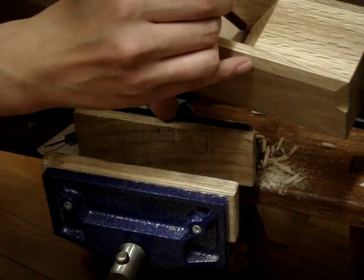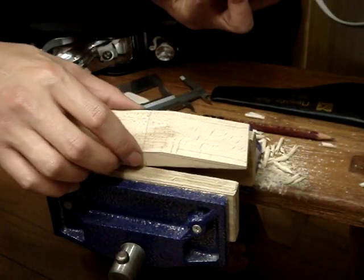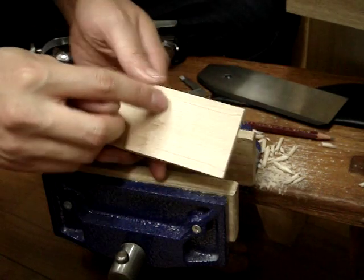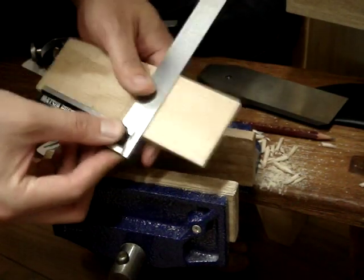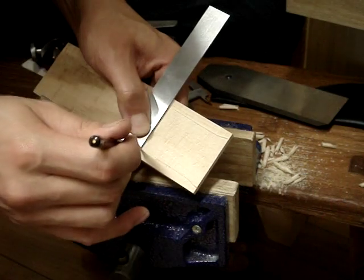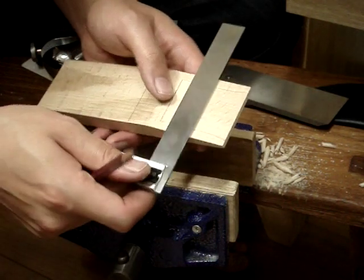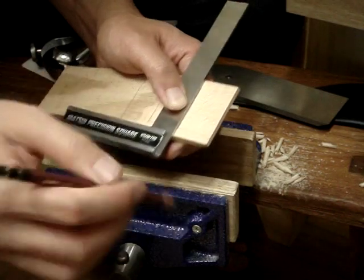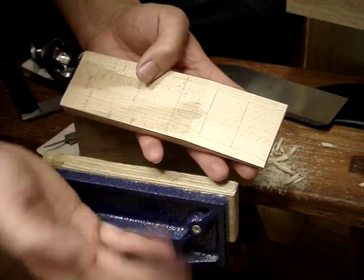Get the wedge back out and this is the kind of shape you'll have. This is the waste area, so you want to get a square and mark across the top — basically this will be the start of a slope down. I'm going to mark a little bit further down here, an arbitrary kind of line. Here you can see my basic wedge shape.